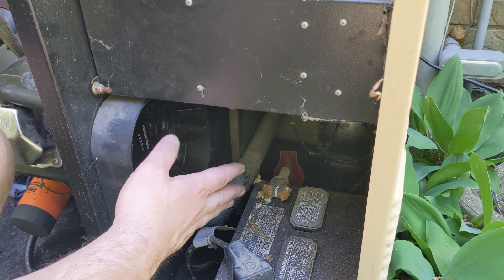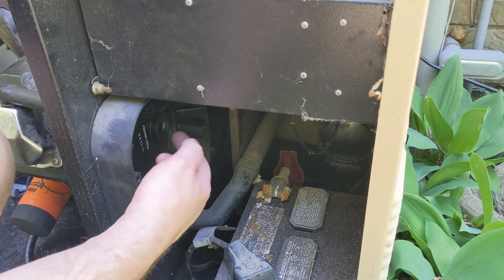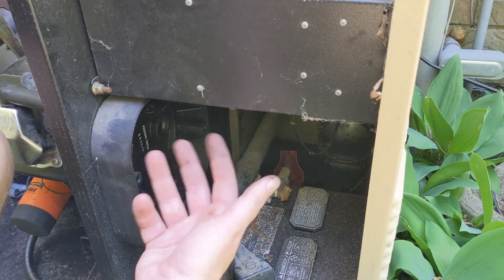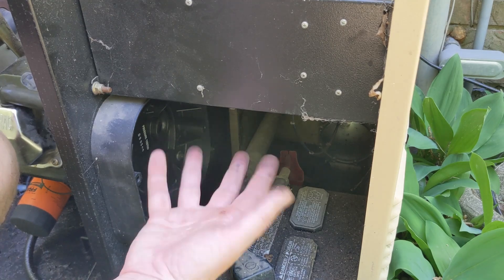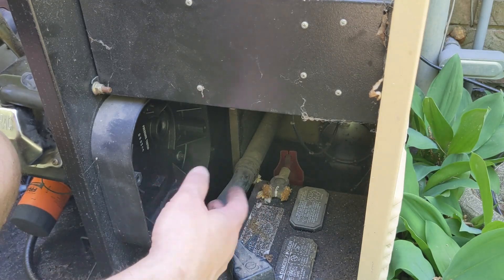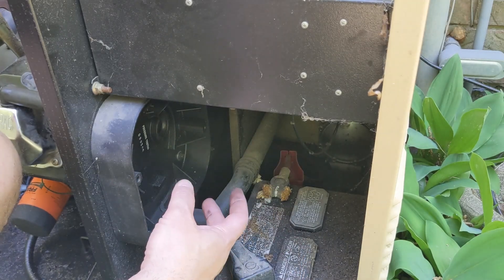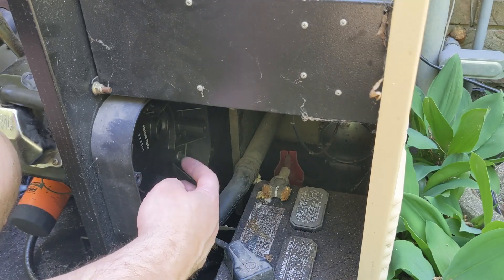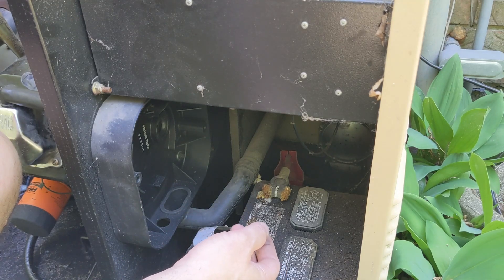I can feel it pulling air in, but it's making zero difference when I cover that up. That is not changing anything, and I can definitely smell gas, so it's definitely getting some fuel. I don't know that it's getting the correct amount, but usually these valves either work or they don't. My experience is they don't typically go to low pressure — they're either giving you the fuel you need or they go bad and quit. I definitely smell fuel, so I'm less likely to believe the problem is back there. Let's go over to the engine side and take a look.